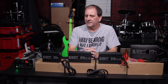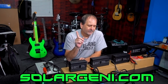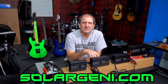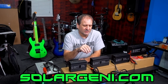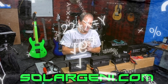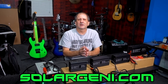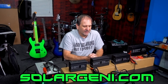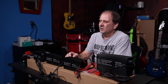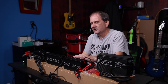This little 120-watt charger comes in at $60 on our website or on my eBay store. Then we've got our C600 model, which is a heavier duty unit — around 460 to 480 watts. At 7s for an electric bike, this is going to put out 15 amps, and you're going to charge that battery pretty quick. Drop it down to 12 volts and you're looking at 20 to 25 amps.